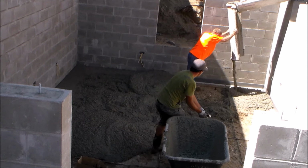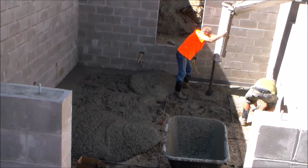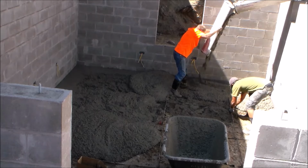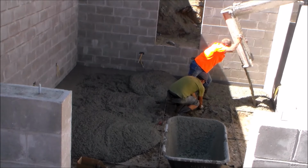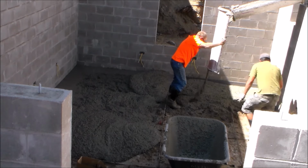With the last chute on backwards like this, and the chute in the unlock position, you can start guiding where the concrete shoots out fairly easy. Right here, we're trying to spread the concrete out evenly at about 4 inches thick using the chute. And since I'm not using the wheelbarrow in this area, I can go ahead and get my rebar stands in place.